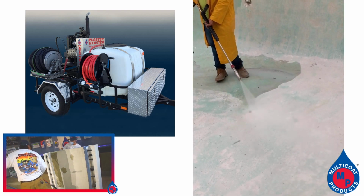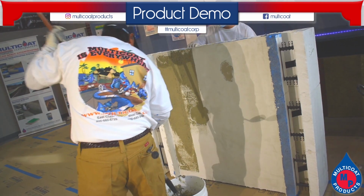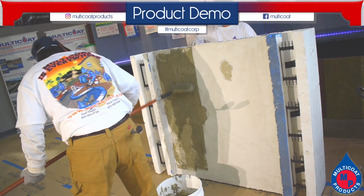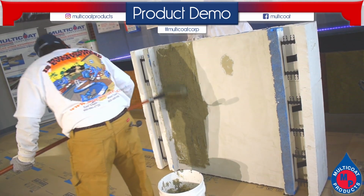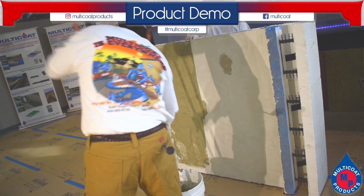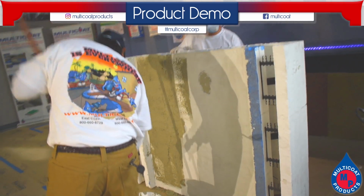Next, we're going to show Alfonso here. He's rolling our scratch coat product. So our scratch coat can be rolled or can be sprayed. You get up to like 200 square feet per bag. We sell the scratch coat in 2 different formats. We sell it in a white bag that comes with all the polymers and everything inside. All you need to do is mix with water.